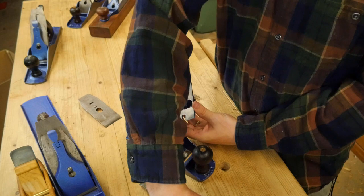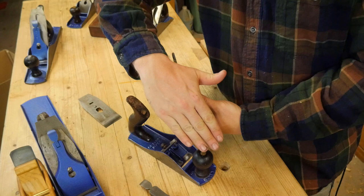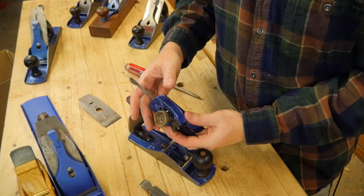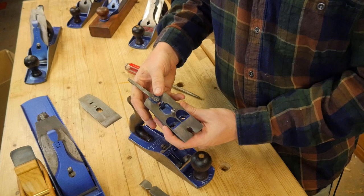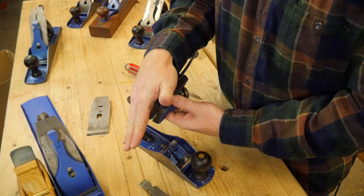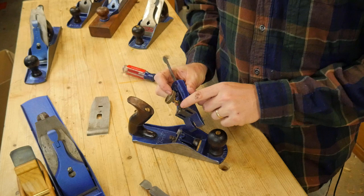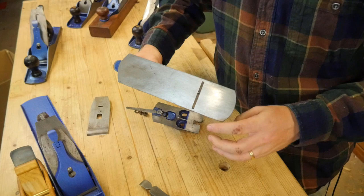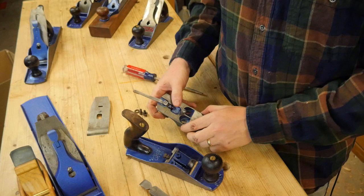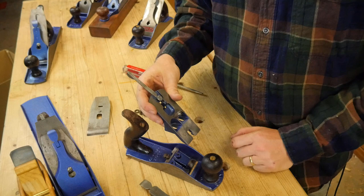On the frog you have all of the adjustment. The lateral adjuster is this knob here — it controls the blade side to side, so if it's cutting deeper on one side you can turn it to even things out. Then in the back you have the depth adjuster, a knob that rolls in and out. That knob connects with a lever, and the lever connects with the chip breaker, so as you move it in and out the whole plate slides back and forth, adjusting the iron deeper into the cut or pulling it back. On some later Bailey patterns there's also a screw that connects with a point on the frog, allowing the frog to move forward and back so you can get the blade closer to the front of the mouth. On others you just loosen the screws to slide it, but this screw makes it easier — loosen slightly, use the screw to slide to the right location, then lock it down.